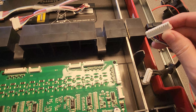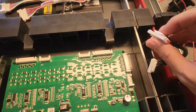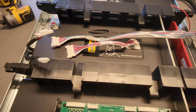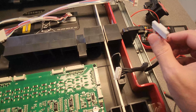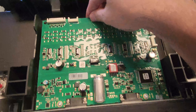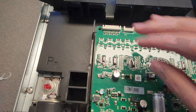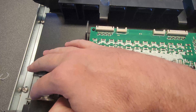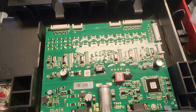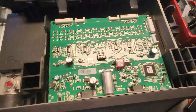I could just cut this anywhere and attach all my BMS leads to the corresponding wires, but there are only two of them. The third one connects directly to the PCB, and I haven't been able to find a matching connector yet. I've got a query in to somebody who might know. Worst case I can wire those two with a harness and cut the third one up, but I really don't want to do that. I'm also going to remove this PCB and support structure, since the BMS will probably sit in here.